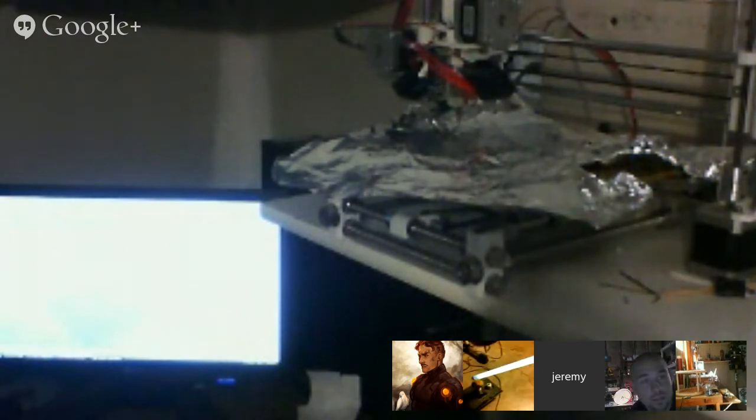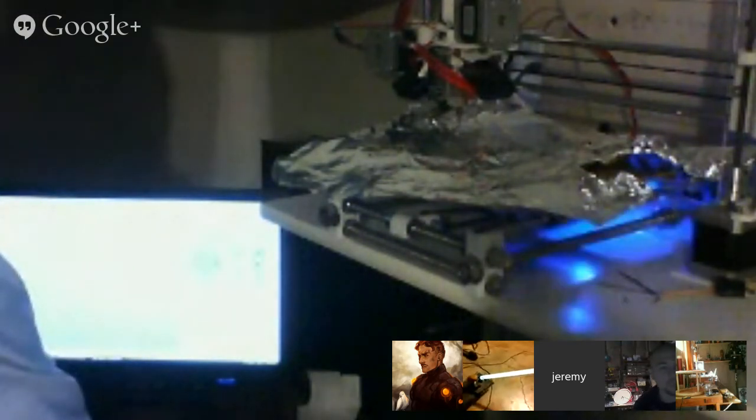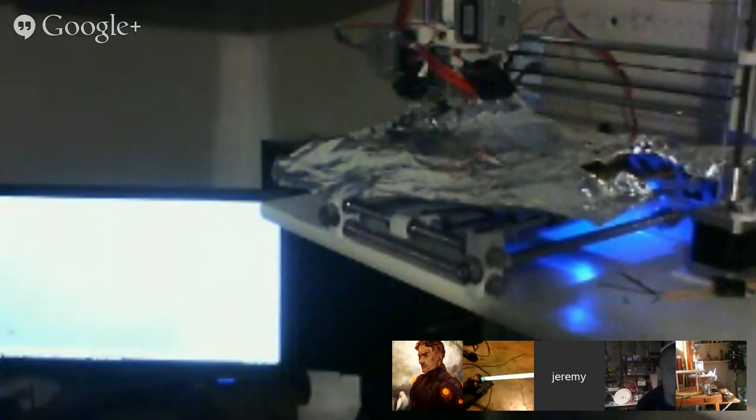Does anyone know how I can burn the diodes inside a flyback without burning the actual flyback? Overvoltage maybe. Push too much through. Yeah, backwards. Actually, it's probably an even simpler answer. Back spike, some crazy back spike. It's a pretty robust flyback, since it survived so much time running a Tesla coil.